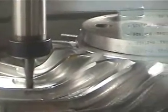We have started doing the hub finishing with a half-inch ball mill. We are trying to soften that surface over there — you can appreciate how it's smoothing the surface. It's also a complex 5-axis machining and it's going to take a long time. We've checked and it's doing it very well, so let's leave it running for about 6 or 7 hours and we'll check how it accomplishes the task.